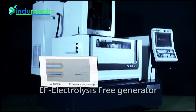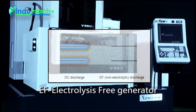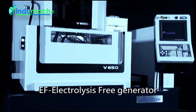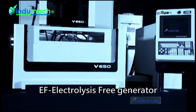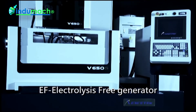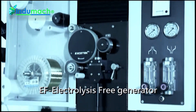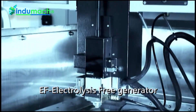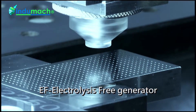The power system for processing: the electroless fine finish power produced by the EF Electrolysis-Free Generator allows full-time use of AC electroless discharge processing on titanium alloys or super hard tungsten steel, without electrolysis on the material surface. It can reach a standard power finish less than Ra 0.35, and the workpiece has a smaller softened layer after processing, giving the mold an excellent service life.